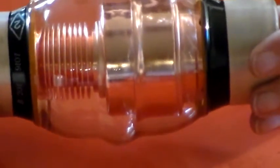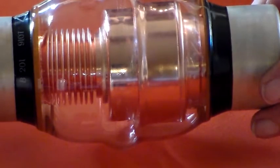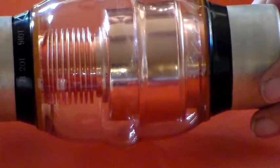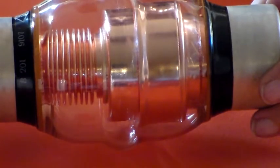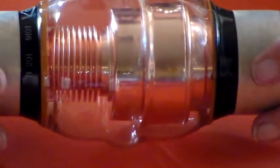So you could tune a loop antenna with a fairly decent amount of power with that — a 25,000 volt capacitor, 5 to 100 pF. The one I've put in the box to tune my loop is a much lower voltage working, but it's certainly fine for running 100 watts into a loop. It's 5 to 250 pF, which gives a much wider tuning range — 100 pF might be a bit on the small side. The actual tuning range on the loop might be limited, but you can certainly put a lot more power into it with a capacitor like that.